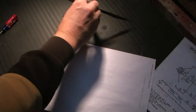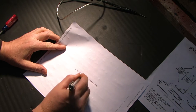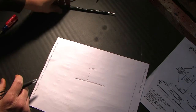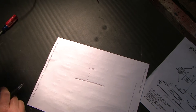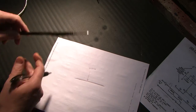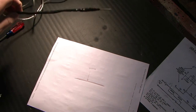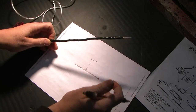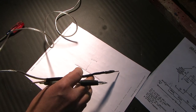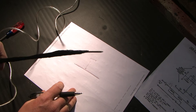We're going to begin with a wire. I recommend a heavier gauge wire, something like 16 gauge — not that thin 20 or 22-plus gauge stuff. I happen to be using some speaker wire, just leftover wire that I had. For the probe — the piece you're going to be touching to capacitor leads to discharge them — you can use anything metallic. I've used a nail; it's a finishing nail.